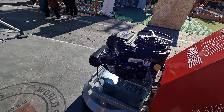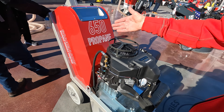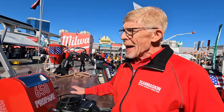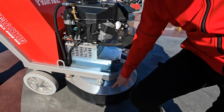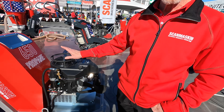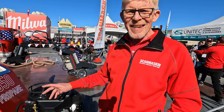This is the machine right here — the 25.5-inch, the 650, which is 650 millimeters — that's the width of the cutting pad. Hands down the toughest, most robust 25.5-inch machine on the market. It needs next to no maintenance other than changing the oil, changing the air filter, and once every 400 hours there's a v-seal inside that we change. The track record shows very few belts broken in 10 years.